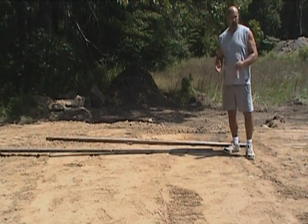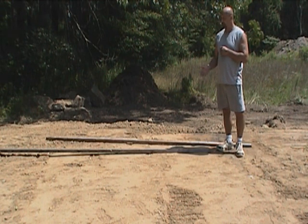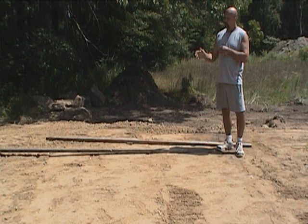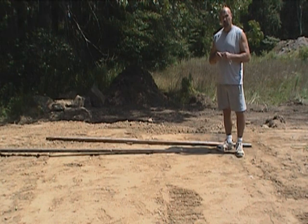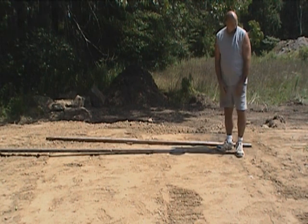It's solar noon. Off of our northeast corner, we've put a 16-foot 2x4 down. I'm going to stand a 12-foot pole up now, level it, and make sure the shadow is cast directly on that line — and that will establish our true north-south. We did this with a compass, but it's difficult; the compass is very small when trying to establish long lines. So we're double-checking it using the solar noon method.